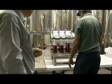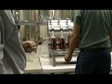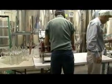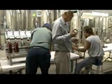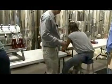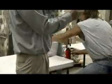This right here is the corking machine, and these are neoprene corks. He drops that in there and it goes through this compression chamber, squeezes the cork real tight, and then it punches it down into the bottle.